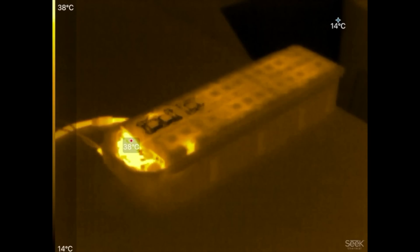We can see how the temperature climbs in there. With the thermal camera, it's at 39°C — those two hot points on the battery are where the cables exit. Now at 40°C with 26.7 amps flowing.